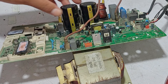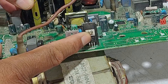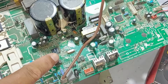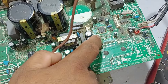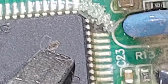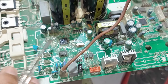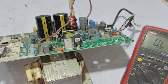I have worked on this circuit board off-camera and found the problem. When I removed the 15-volt voltage regulator and checked the 5-volt regulator, it was still showing the same readings — meaning it is also faulty. All the smaller components on the low side work through the 5-volt regulator. When the 5-volt regulator is bad, my doubt was confirmed that it had damaged the microcontrollers on this circuit board. The main component is the MCU — the voltage regulator has damaged the microcontroller. This circuit has 2 microcontrollers: the MCU on the right is the main one, and the MCU on the left operates the IPM. Both MCUs were communicating with one another, and both went faulty. This means this circuit is dead — it cannot be repaired because I don't have these microcontrollers with their program.